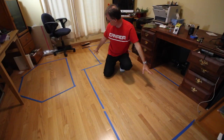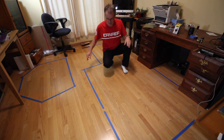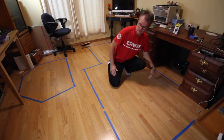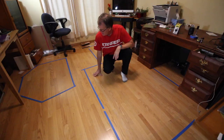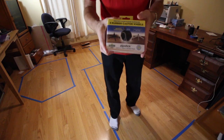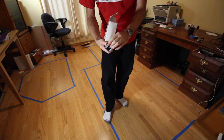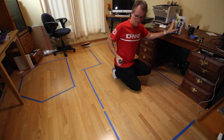It has been about 24 hours since the last coat and I think it's turned out really good. It's fully dry so I can walk on it, but it needs two more days to cure to full hardness. It's by no means perfect or brand new, but I wasn't expecting that. Especially along the front, it is a lot better. I did about four or five coats up there. I can still see where the scratch is; we'll see if some UV exposure will blend it in over time. To prevent this from happening again — not sponsored — I've got replacement wheels for most of our chairs. I picked them up off Amazon; they have a soft rubber wheel that does much less damage to the floor.